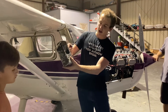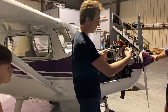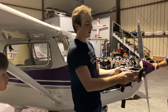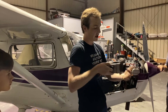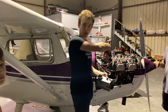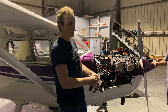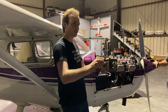Inside this is a little flapper that moves forward and back. In normal operation, with the air filter and carburetor up here, it's pushed forward — air comes in through the center and up into the carburetor. If we pull carburetor heat, it closes off air from the front and starts sucking air through this side port, which has heat coming from the exhaust shroud, now heating up the carburetor and melting any ice. You can see it move, but you can't see what it's doing.